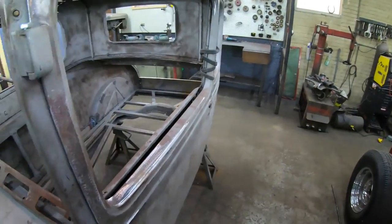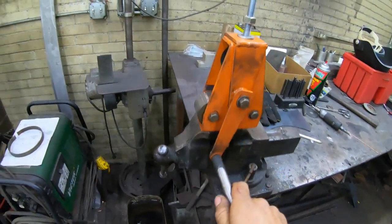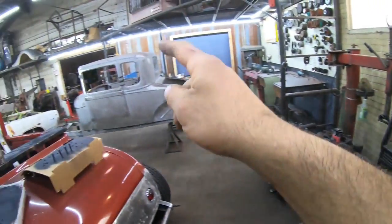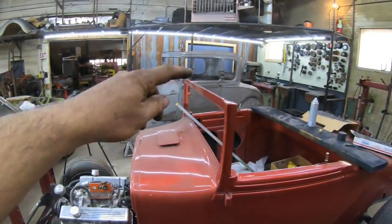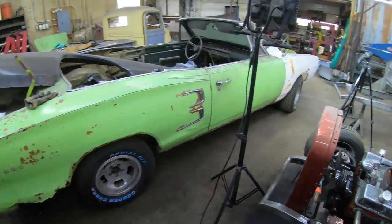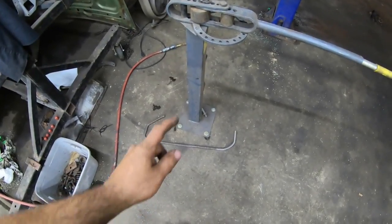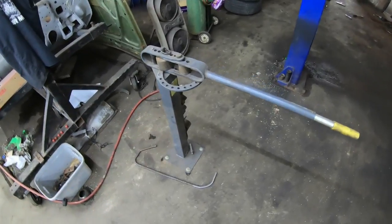So I just made a video a little bit ago on the mini metal roller. I made this thing, oh geez, probably 3-4 weeks ago now. Got a couple of wheels in there. Basically, this is what I use, or used, to arch that first bow that's sitting up there on the header panel. And then as for the corners where it gets tight when I do the perimeter around the car, the corners in the back are a really tight bend, which the mini metal roller will not bend, but I did set up my other bender over here on the floor and actually just had to clean out the anchors in the floor pretty good because I don't think I've bolted this down in the last 8 years.